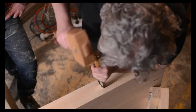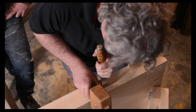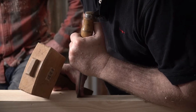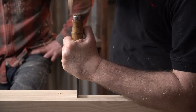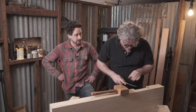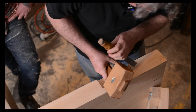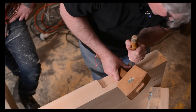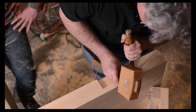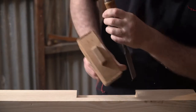Once you've got that shape defined, you can get in and start to remove the bulk. The more material you try and take off at any one time, the more chance of inaccuracy, so you just kind of creep up on that line that you've scribed. I never go along the grain first - I'll go across the grain - because if you go along the grain there's a chance of splitting. It'll just tear those fibers out, and this is coarse timber.